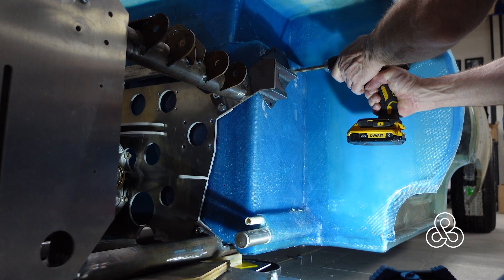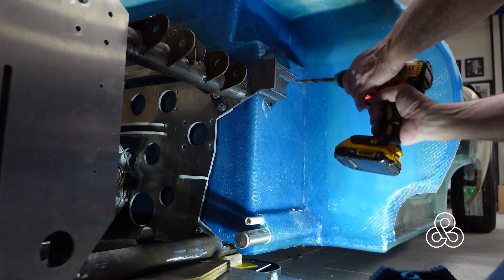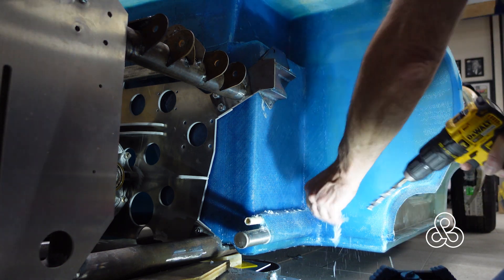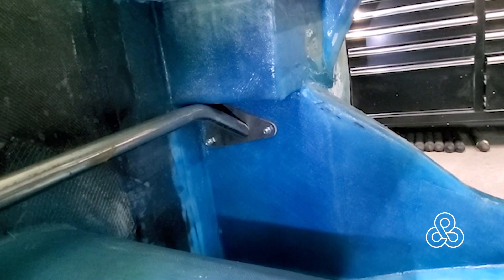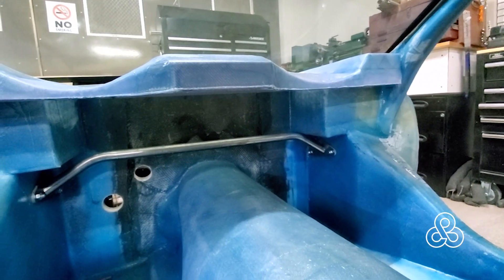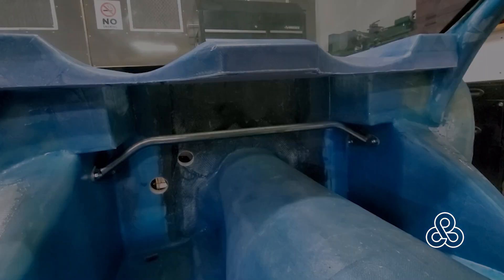As a little bonus, I'm going to show you the front subframe. The front subframe is put into place and I'm drilling through into the footwell area. This is where the front subframe attaches on the side — there's a plate on the inside where the bolts come through and another bar structure in the front. We'll be adding some tabs for foot pedals and steering columns. So there you have a little more rollover and impact protection. I'll put up a video that talks about the materials and how the malleability of these roll bars helps add protection and transfer those loads.